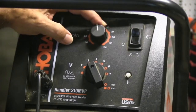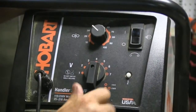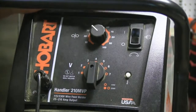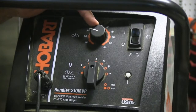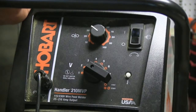This is an infinite setting on the wire feed speed, but this is what's known as a tap or click setting on the voltage. The only drawback is that you can't adjust it while welding. What I'm going to do today is find 250 inches a minute and get it exactly right, then get a piece of scrap metal and set the voltage way lower than it will need.